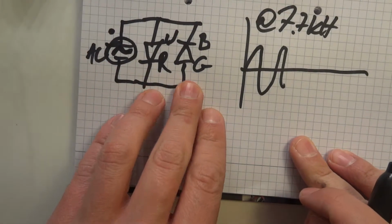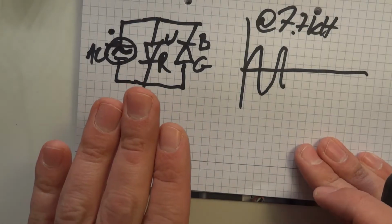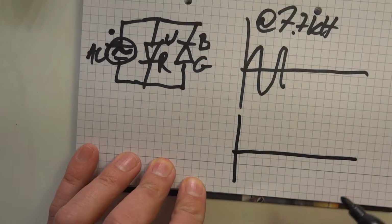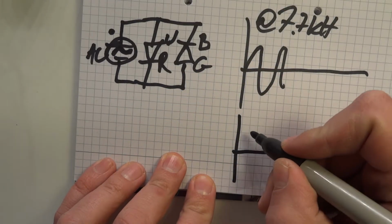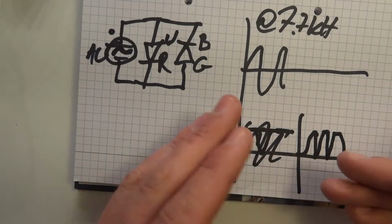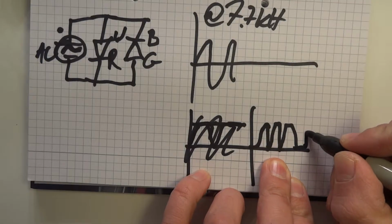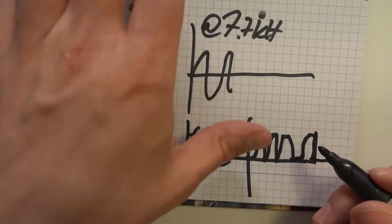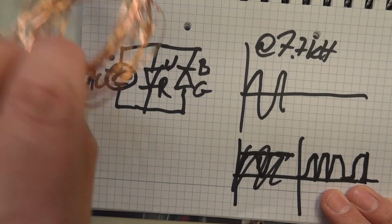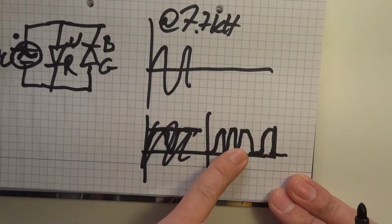And now, consider that it turns on one set of LEDs and then turns off the other every, let's say, half a second, because it's blinking. So it's doing almost this, but in this manner. So the way the AC would look like, it does something like that. Let's ignore this because it also introduces the brightness, so you can dim it and all the things. It also can have some kind of breaks in case it needs to be a little bit dimmer. And if it runs at 7.7, for this one it will only light the white and red LEDs. So what your eye would perceive is that the white and red LEDs are lit, and the blue and green aren't, because it is only doing a half wave.